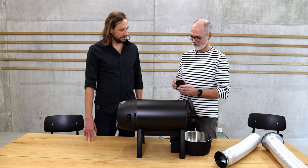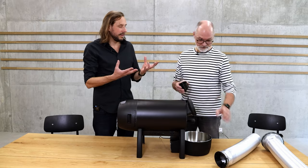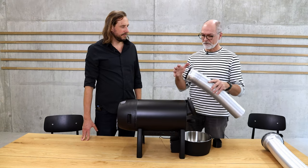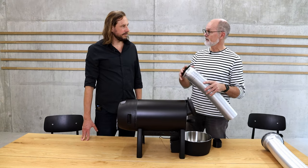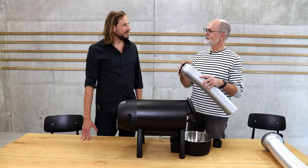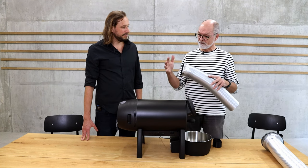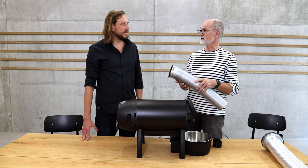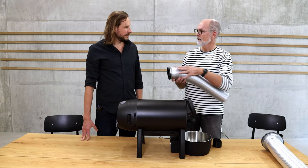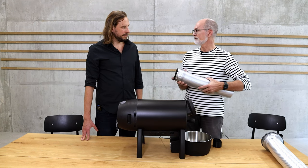Okay. Sure. And then you have those parts, and then you also need the hose or the tubes. What do I have to look for when I buy tubes? With our parts, there might be variations out there. I think with some communities, people are actually hacking those models for a good reason, to have other diameters. But this is made for 100 millimeter hoses, which is pretty normal in Europe. And then aluminum hose. This is a flexible one. You can actually stretch it out to like 3 meters at the most.